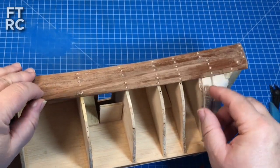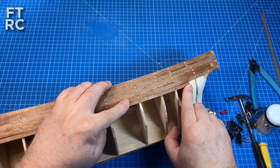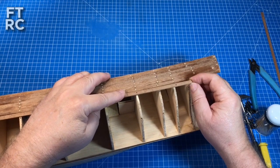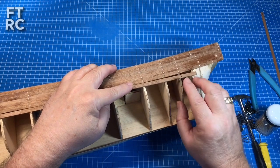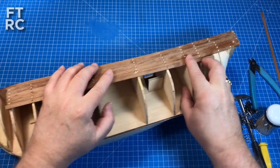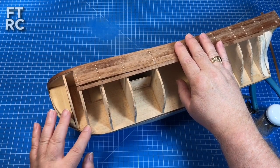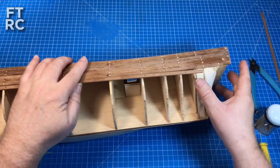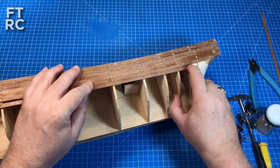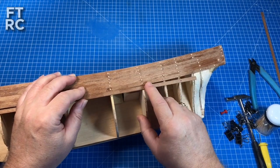Now you'll also notice with these last two planks, instead of planking all the way to the end of the stern, that's so that it's easier, because otherwise we've got some very complex curves here and they're hard to do with the thicker planks. The trick that I'm doing, if you haven't seen the previous videos, is we're doing the relatively easy areas that require minimal bending with the thick planks, and then we're going to chock in. I'm still yet to do the bow, but we can't do that till this is done. But the stern has been done and we can butt up to that now. If you don't know how I did all that, you'll have to have a look in the previous videos.